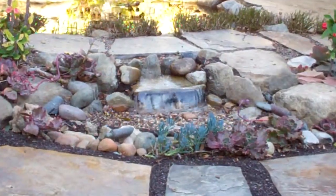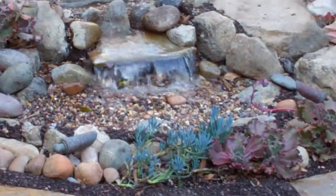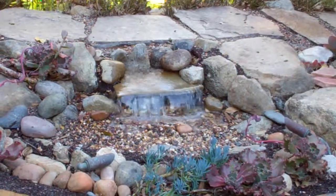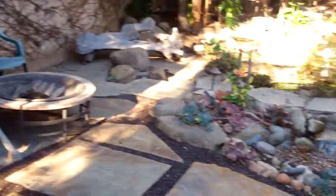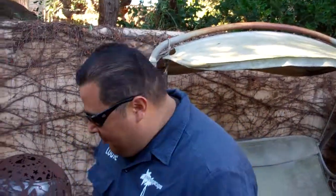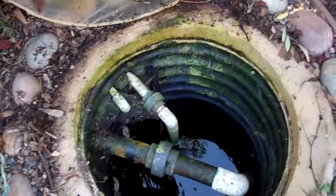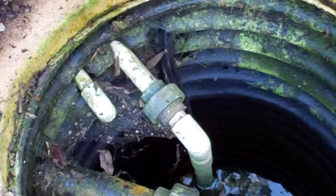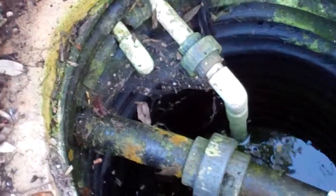We always need to aerate this water — if we let water stand for too long it will get stinky and smelly. So that water you're looking at fell out of the sky about 24 hours ago, and we are constantly recycling it. Here at EnviroScape Headquarters you can always see rainwater just by looking at our waterfall. The other series of pipes here includes a foot valve installed in the vault, which is how we're going to get the water out — it's connected to an external pump on that side over there.